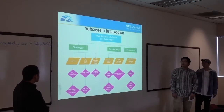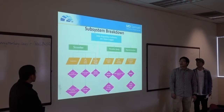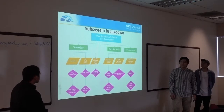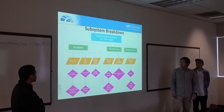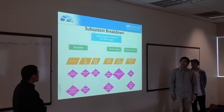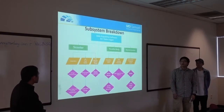For the throttle body, as mentioned, we're looking to automate it. So we're exploring the servo, measuring the speed and the torque, and also looking at the EPA driving schedules, which will be the information for us to determine what kind of driving styles, whether it be highway, stop and go traffic, or urban. And also, the dyno currently is pretty much a standalone piece of equipment. We're also looking to automate that piece of equipment as well, and hopefully have that input data into our data acquisition.